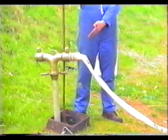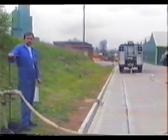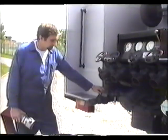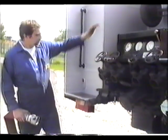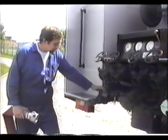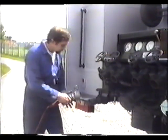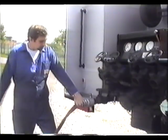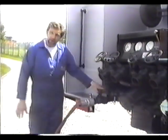The main source of water will be from a hydrant, which will feed the fire engine. Obviously before we can use the first aid hoses on the vehicle, we must ensure that the first aid tank is full. This is situated at the middle top of the vehicle. You'll need a pipe attached to a standpipe; attach the other end to the foam cock. Open the valve on the standpipe to deliver water, then open this valve, which will slowly but surely fill the first aid tank.